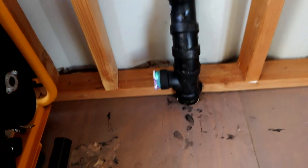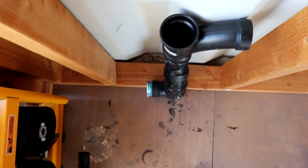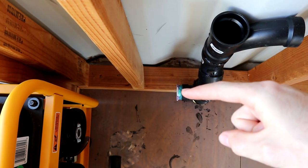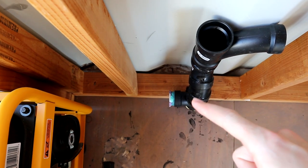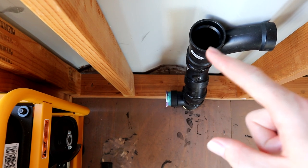But as you can see, this is not flush with the wall. The reason it can't be flush with the wall is because there's a beam actually from here to the 2x4 of metal around the entire container, and I can't drill through that to run this. So I have to have it come up and then 45, and then come up again.